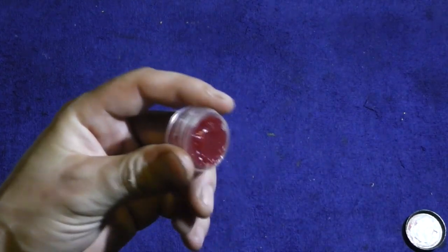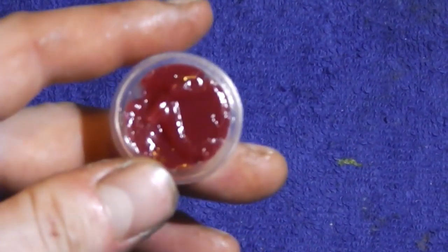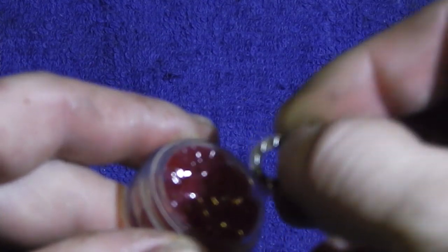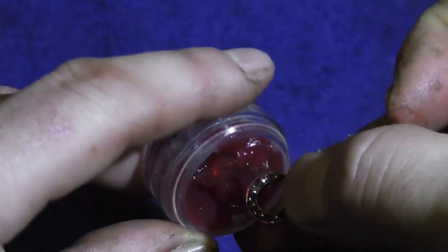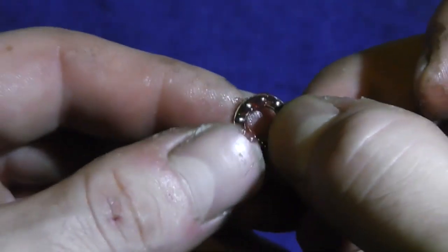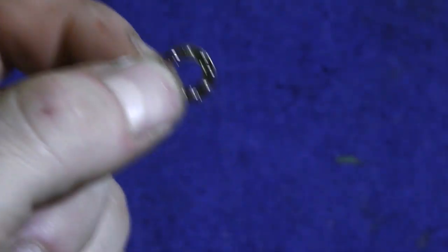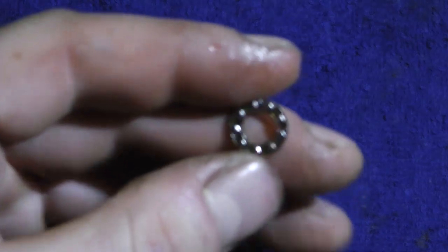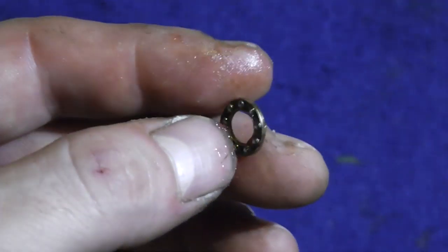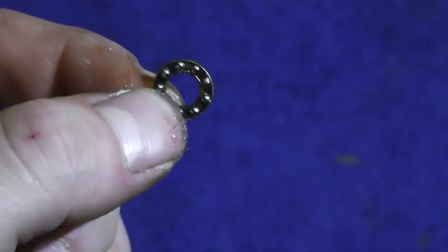Make it easier to manage, put it in your flight box so you always have it with you. We primarily use this high-temp thick grease on thrust bearings. In that pocket where the rollers are, just dip this in and go around. Pack that in your bearings really good — push it all through, get it all over the place. Don't be afraid of it. This will prevent corrosion, keep things running smooth, and reduce issues. Why run a bearing with no lube and have them rust out, your thrust bearing comes apart, and little BBs go all over the floor?